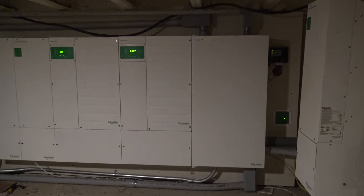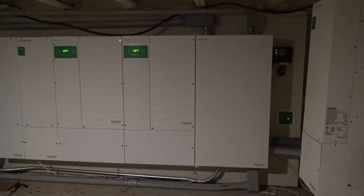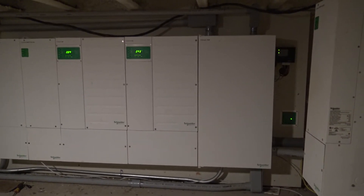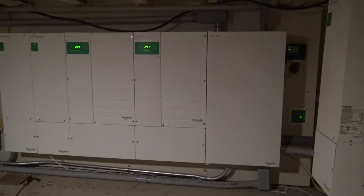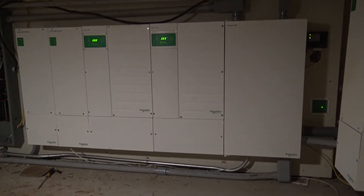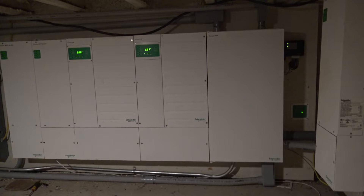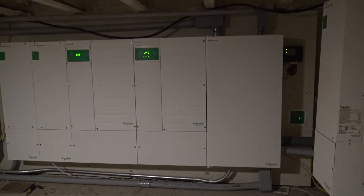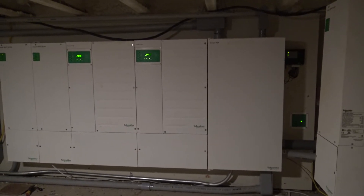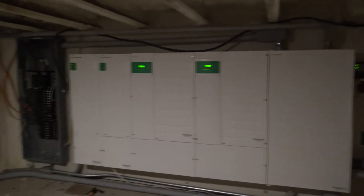Big air conditioners and equipment — you put soft starts on them so it only draws 30 or 40 amps instead of 60 when it kicks on, starting slowly so the amperage drops. Once the machine is operating continuously it's only drawing about 35 amps, which leaves me about 45 amps to play with. I also have some smaller ductless mini-split systems that run about 10 amps. Throw a couple of those in and you're up over 40, 50, 55 amps. Add the water well — that's another 25 amps — and you can see how quickly you exceed what your system delivers.